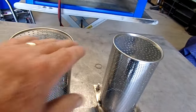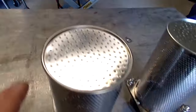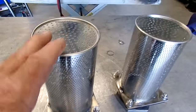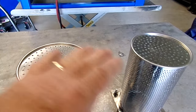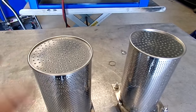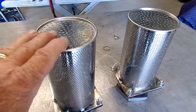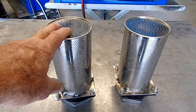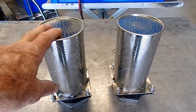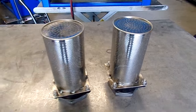This is all stainless. You'll notice there's perforations on the top where air can flow through, as well as on the sides. Most tank filters are all solid metal, so you don't get any flow of air coming in — it's a lot of restriction. That is what you don't want. You don't want restriction because that creates differential on your blower, starvation, because you want air to flow into your blower so you get maximum CFM and vacuum recovery.